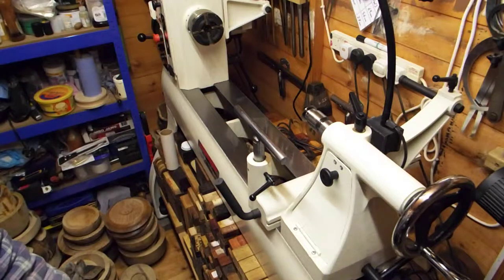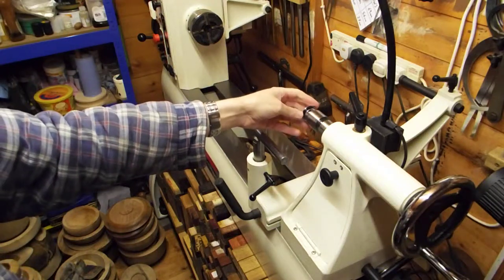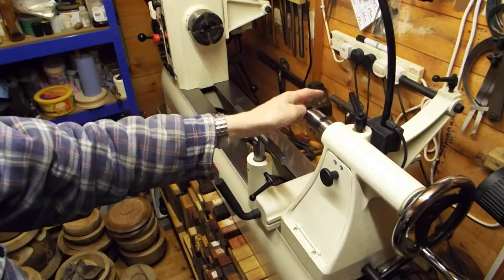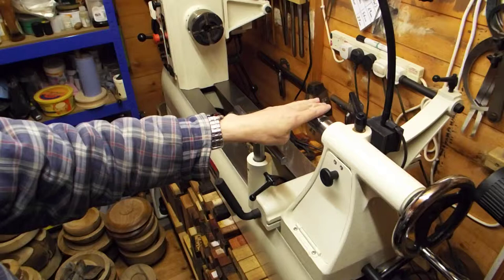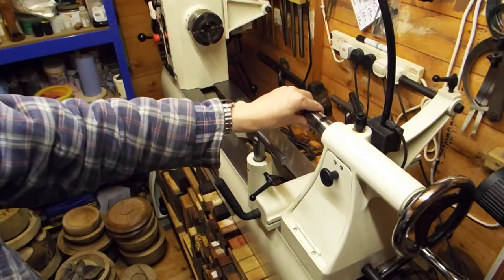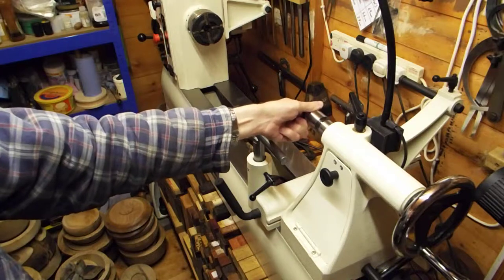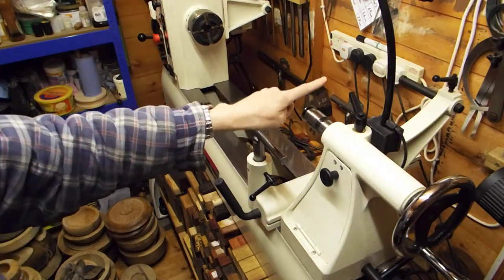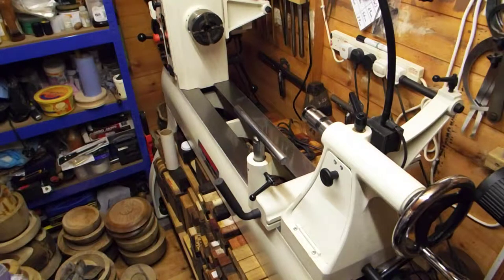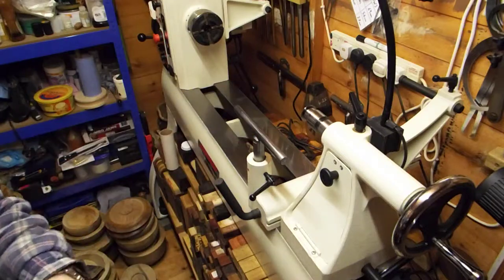But there is something wrong with it that I've found - I've only had it about 14 months and already there's play in the bearings. Now when I say play in the bearings, I don't mean a massive amount of slop, I mean a small amount of play. Bearings have got to have a certain amount of play in them otherwise they'd just be locked up solid, but this has got more play than it should have. See if you can hear it. That was an expensive live center and it shouldn't be doing that after 14 months, so I'm not happy, Mr. Axminster.